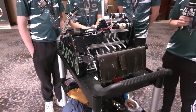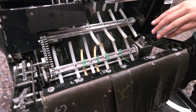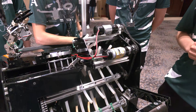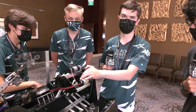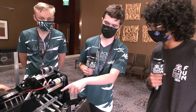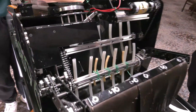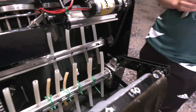We started with 70 durometer McMaster-Carr surgical tubing — that was kind of the first thing we tried. Then we actually changed the surgical tubing on the top ones, since it has to go over a pretty dramatic curve, so that's 50 durometer of the same stuff. It's really sticky and all around great. Another cool thing about how we mounted these — they're x-rails with just a hole drilled through it, and you can put a set screw on it really simply. It's a bomb-proof way to do it; you don't have to cut them up or put weird 3D printed pieces on. We also saw that design on Wolfpack Machina — I know you mentor that team.